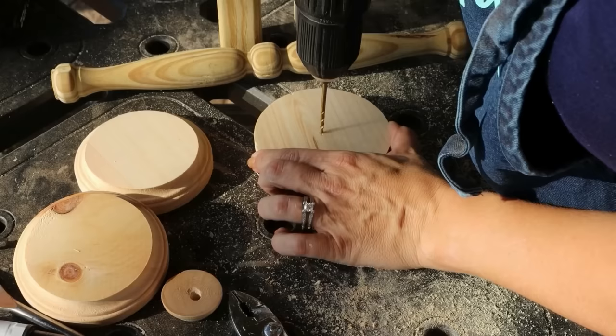We start by building the frame. I picked up three 36-inch long, 1.5 by 1.5-inch poplar pieces from Home Depot. We keep two at original length and cut the third directly in half. A quick safety tip: normally I have clear protective eyewear but couldn't find them, so I'm using sunglasses to prevent sawdust. Between each use I always unplug the saw, especially with little people around.